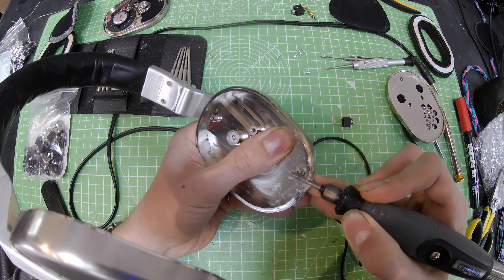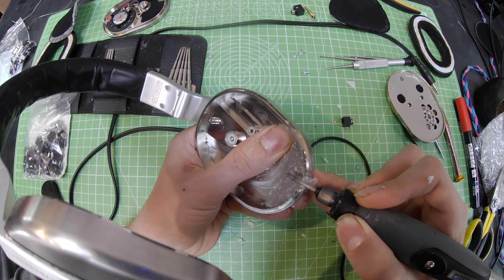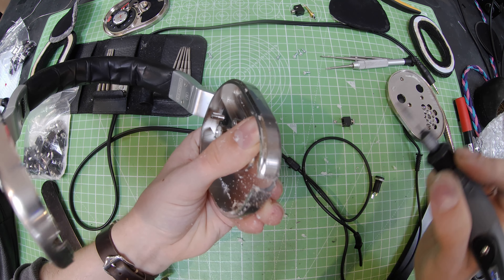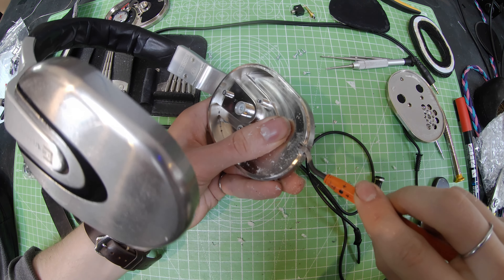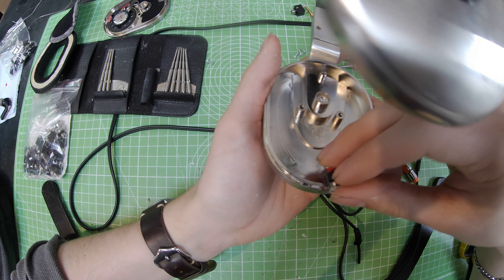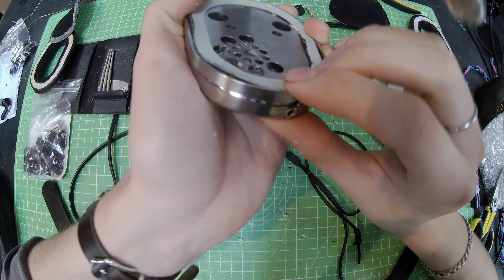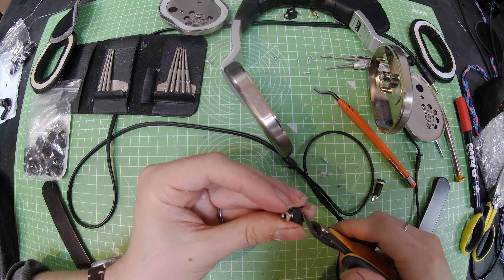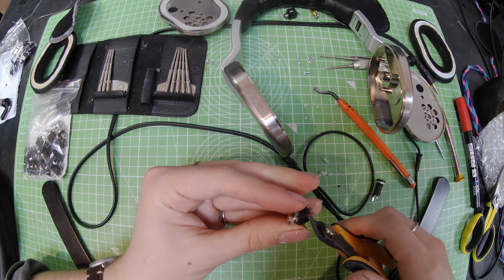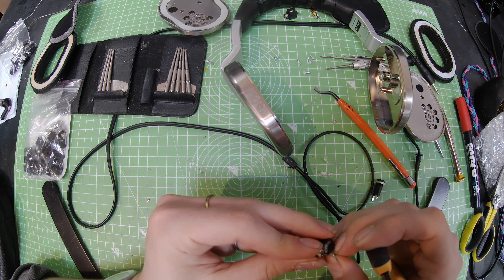You can really see the white plastic here and it feels all nasty and cheap and horrible, and yeah it grinds away. It's quite a thick outer metal coating but yeah it's not great. Remove the burrs there, see if the socket will fit. You saw me paint some red onto the driver there and squish them together — some of the red ink transfers onto the socket and that shows me where it's interfering, where it's making contact.